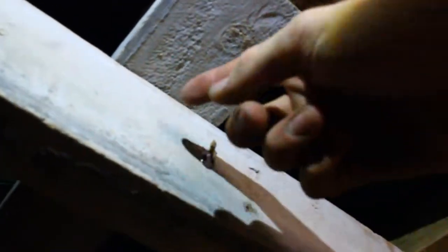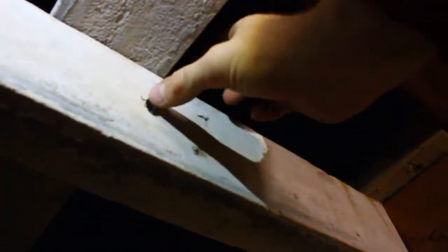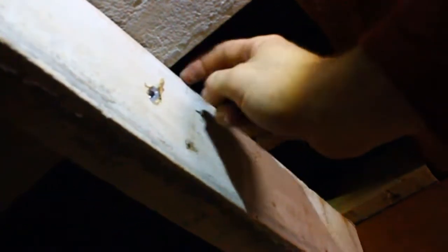And so what I've done is I've lined it up so the purlin that I'll screw down from the top for the heat pump will go straight through this one and this one here, and also pull them together a little bit. I have drilled up there to kind of hold it, but going down from the top will be enough to get, you know, an inch at most into this timber here. The other purlin will go straight into this rafter there, and the other one will go into there, and I just put these on either side just for the support, but luckily I was able to make use of this here. So they aren't perfectly even, but they're the most efficient spacing for overall use.